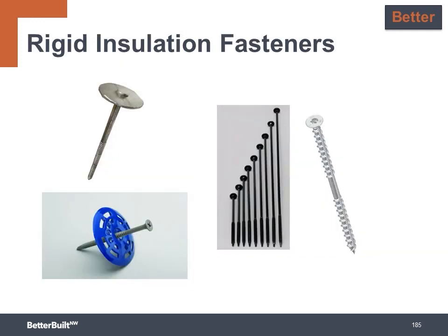There are a number of special fasteners available for attaching continuous exterior insulation. We also see long, specially designed screws on the right, which are for attaching battens over foam when you want to build a ventilated rain screen, and then the battens can hold the foam in place.